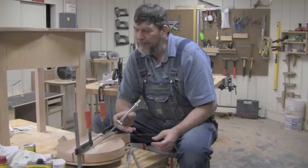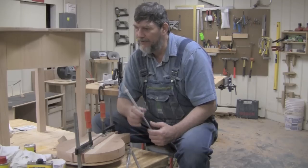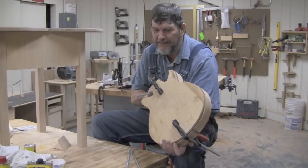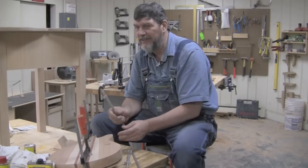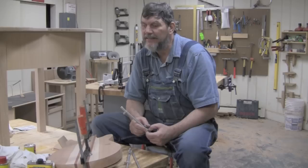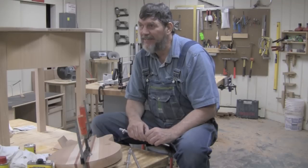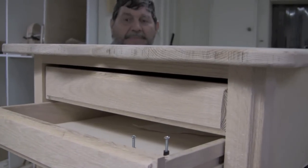We build a little bit of everything around here. This is a solid body guitar body that one of our students is making — he glued up a cherry body with two pieces of bloodwood running down through the center of it. Then we made a plywood template, hooked it on here, and ran a router with a bushing guide on the bottom around the outside to make the shape. He made the template using a copy of another guitar, roughed it out on foam core, attached it to plywood, took it to the bandsaw, then cleaned up with sanding.